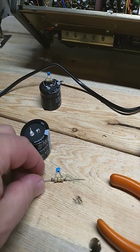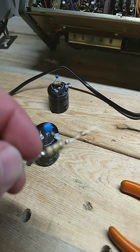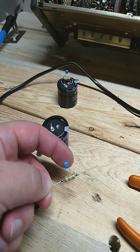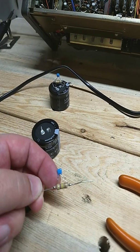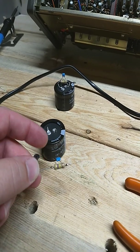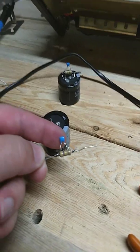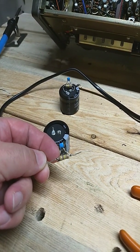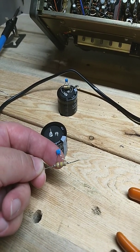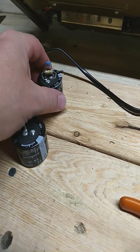Here's another quick video showing some work on the new capacitors — these are the high voltage 500 volt capacitors. This little piece here is the bleed-down resistor along with a capacitor. These come separately, but the instructions from the k4eaa.com website — that's where I bought this kit, which comes with both capacitors, two resistors, and two small capacitors. The directions recommend that you wire the small caps to the resistors and then the whole package to the big capacitor, which is what I've done here.